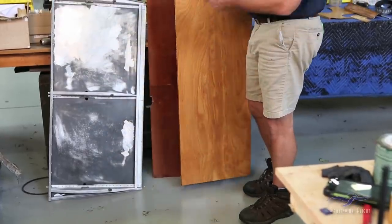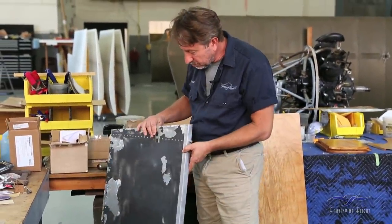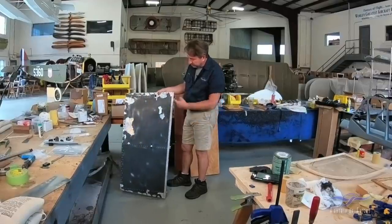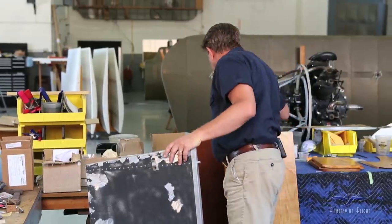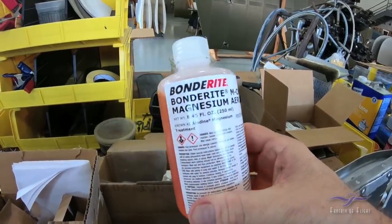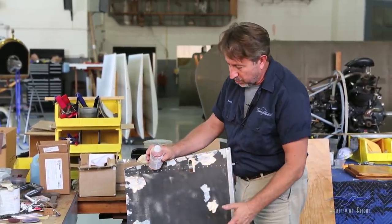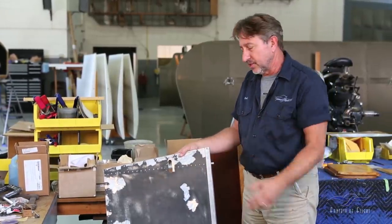Associated with that is the rear back support piece, which is manufactured from aluminum with a magnesium skin. After stripping off the upholstery and old paint, the magnesium had light corrosion that was worked out. Before repainting, it needs magnesium treatment — I found the product Bonderite Magnesium Aero, which replaced the old discontinued Magnodyne. You mix it with water and apply it as a solution to bring the light magnesium back to a darker color, giving it corrosion protection. Then it gets primed and painted before going to the upholstery shop.